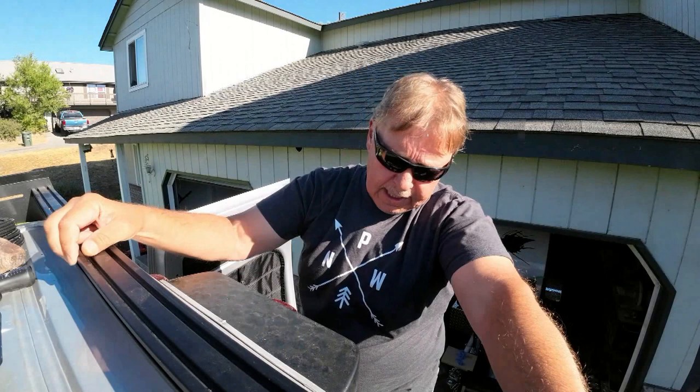If it wasn't for that white wire tie it'd be barely noticeable. We've got our solar panels hooked up and I've got my two ends here with my tester leads — negative on and the positive — and we are running at 20.1 volts. The sun is setting in the west, probably about 20 degrees up, so it's not overhead, and the solar panels are working excellently.